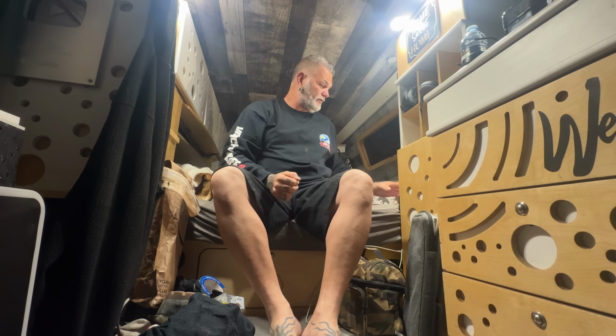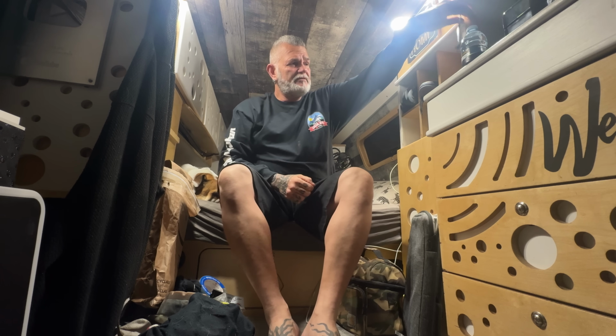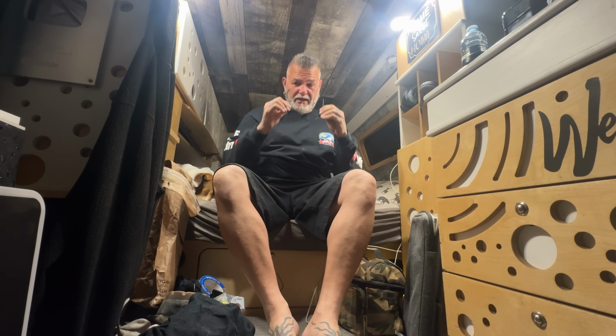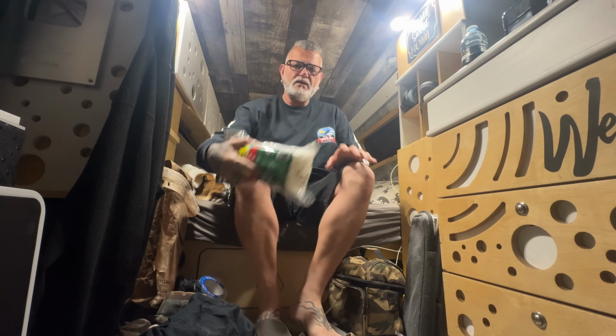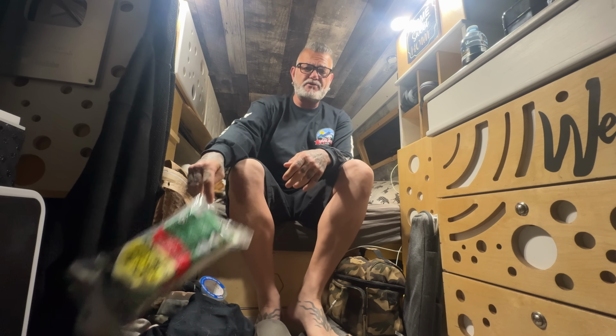Good morning. It's 3 o'clock in the morning, and it was supposed to start raining at 2 o'clock in the morning, so I figured I'd set my alarm for 3 just so I can check on how we sealed up the doors. When they were done yesterday, we put plastic on the outside of the shop doors, because I'll go show you guys. We left the shop doors open last night because we can't shut them because of the epoxy floors. So we put plastic poly on the doors here, and I set my alarm nice and early this morning so we could double check on it to make sure the rain was not getting inside. But let's go take a peek at the floors. We also taped the bottom of the door shut.